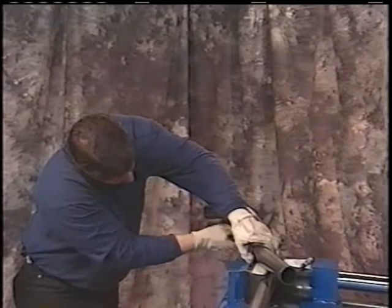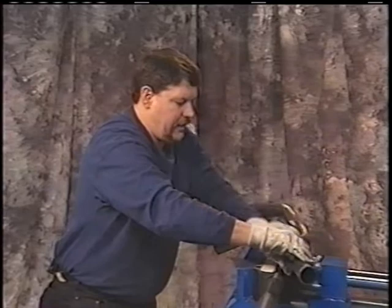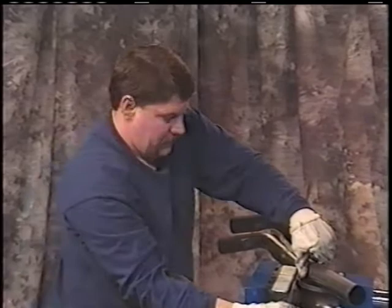This is parallel with your tubing. This gap is the same. You're sitting flat down on that. That's very important as well. Make sure you're flat down on that. Make your angle the same. Go ahead and snug your bender up. Take another look. Looks good.